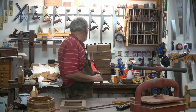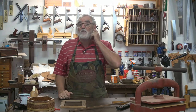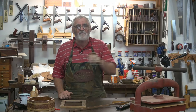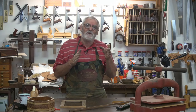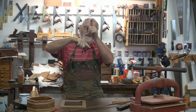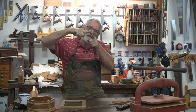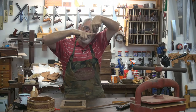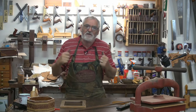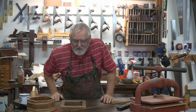Oh, did I? No, actually, I did those on that one I put the sticking on. I did that on the table saw. I set up 8mm depth. What I do, if I want an 8mm cut, I set the saw depth to just over 8mm, maybe 8.5mm. And then the fence depth is at 8mm. So when I'm actually getting a cut, I'm actually incising into the box. So instead of having a straight, clean 90 degrees, I've got a 90 degree, but there's a lead in into the top of the box top and also into the side of the box, and that's as a glue channel. That's something I just developed myself. And then if I do put too much glue in, I don't get a hydrostatic lock and the solid edge popping out. It's a nice little channel for the excess glue to go in. So there you go.